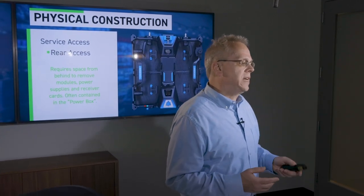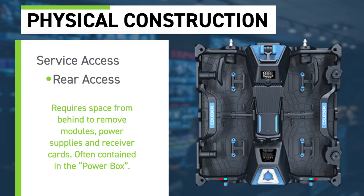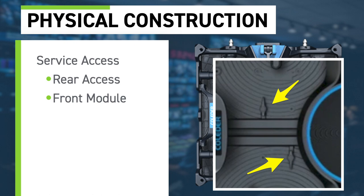When it comes to servicing panels, there are really only two ways. One is called full rear service: you can access small handles on the back of the modules, which have retaining clips, allowing you to get in and replace a module when pixels go out. You also have access to the power hub, which contains power supplies and receiver cards. To remove a front module, you just release the retaining clips and push forward.